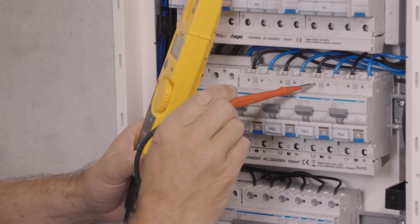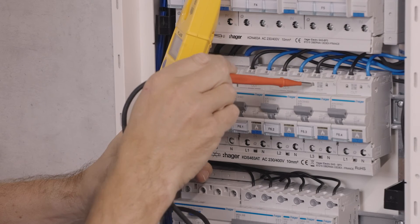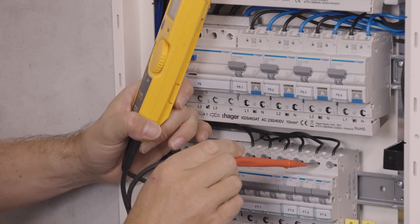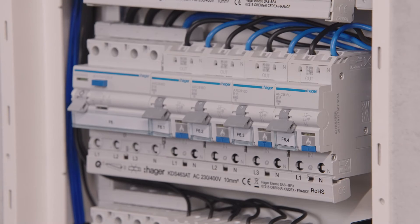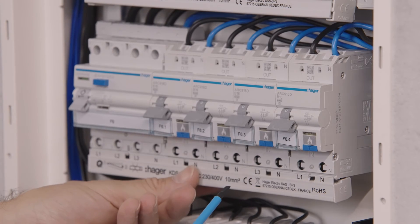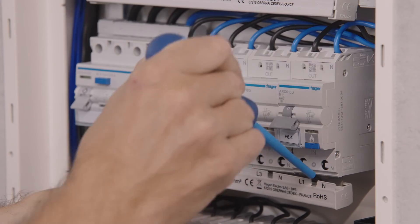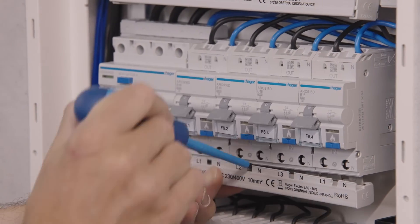To perform your safety measures, just plug in the test probes of your instrument into the foreseen isolated openings — the risk of electric shock is thereby eliminated. If you want to remove a phase bar, use the flat screwdriver in a simple lever movement — no need to loosen the screw terminals.